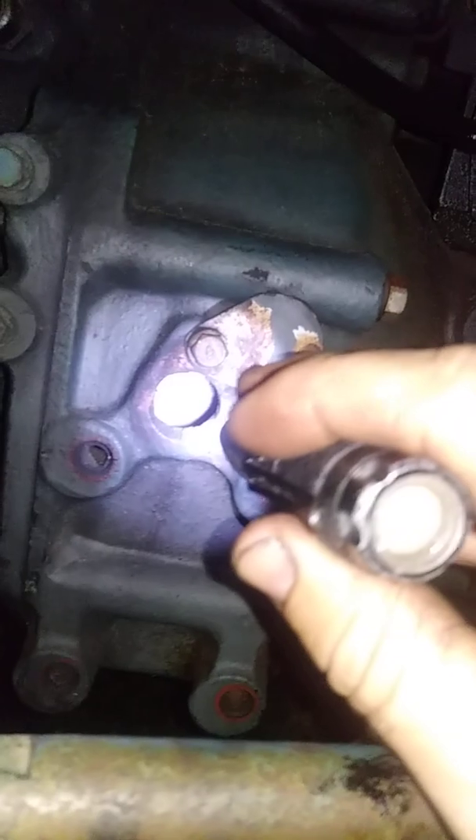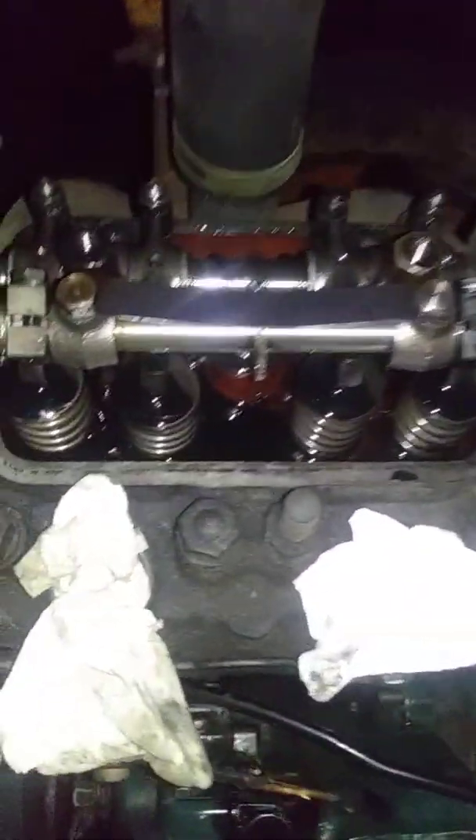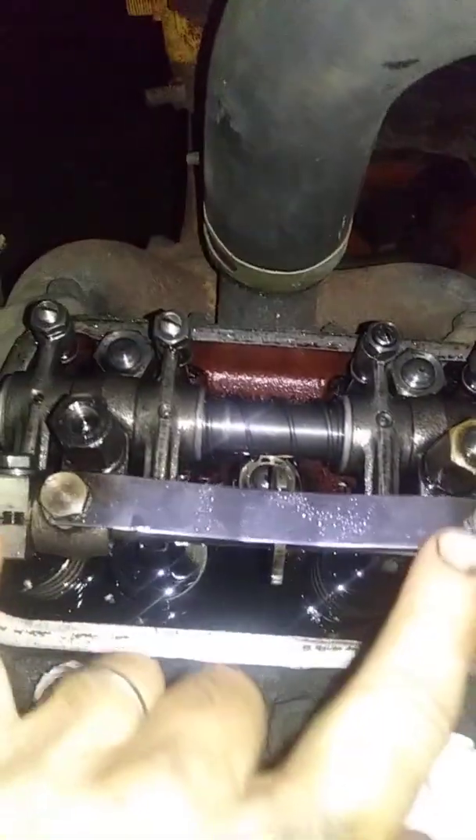It's nighttime here, kids are sleeping. The manual on these tractors is extremely vague — all it tells you is to look in a little window for some timing marks, and none of it makes sense, nothing lines up. So I got sick and tired of it and just found TDC on piston number one on the compression stroke.